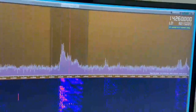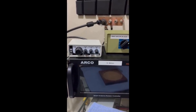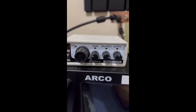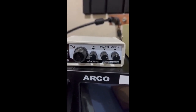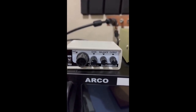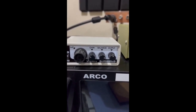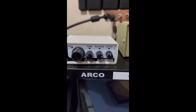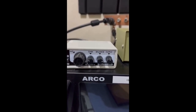Look at that — that's pretty amazing. This is part two of my review of the SV3ORA NR1 noise blanker. You can see the settings on here: the IMD acts like a pre-selector — you peak it per band. The gain I have at the 10 o'clock position, balance at 3pm, output at 12.